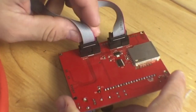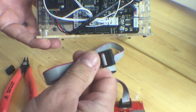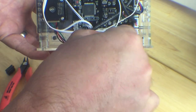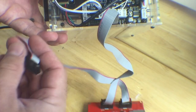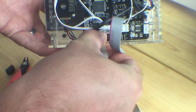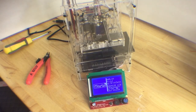I did it for both modules and then plugged into the Fabricator Mini. Make sure you get the EXP1 cable on the LCD matched up with the EXP1 connector on the Fabricator Mini, and then do the same with EXP2. When you're done, these two cables will actually be crossed when you get your display in the proper position. The final step was to plug in power and the Marlin screen came to life, then it switched over to the info screen.